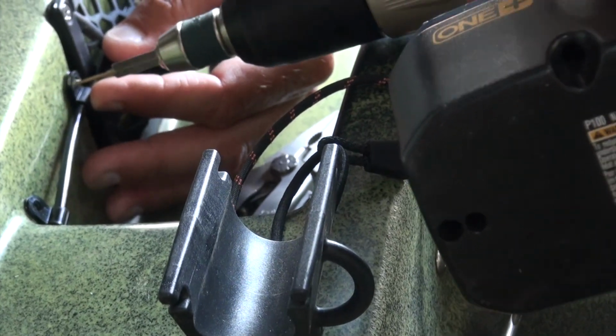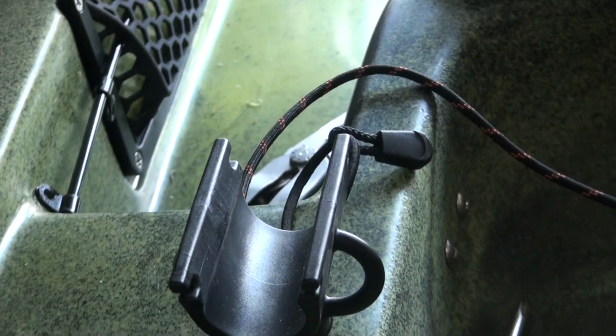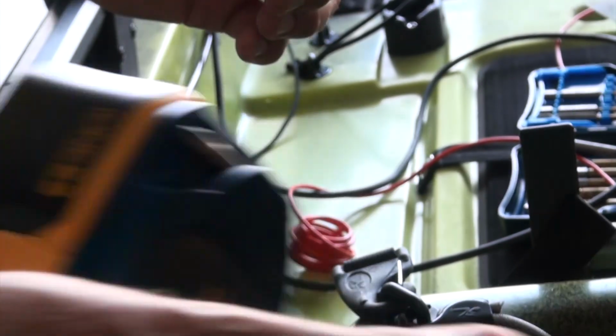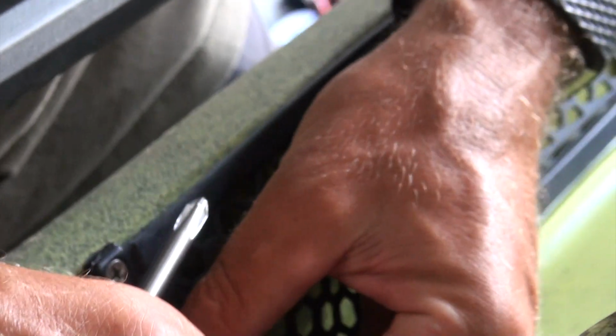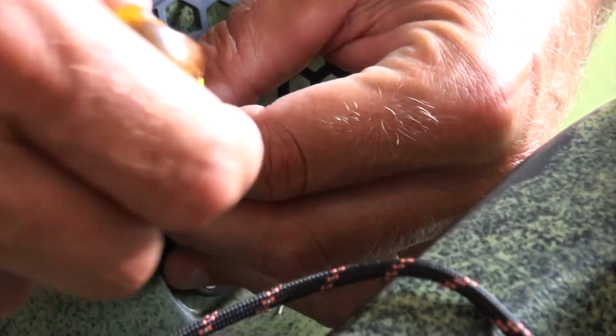It's really just a pilot hole, and if you look at the screws we're using, it's much smaller. So this is pushing a lot of plastic out of the way, and that's absolutely what you want. Makes for a real tight seal, and I don't even worry about the marine goop or the silicone, whatever. I just need the tip in there.